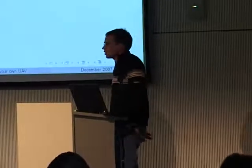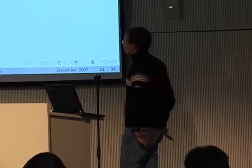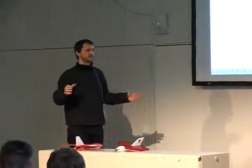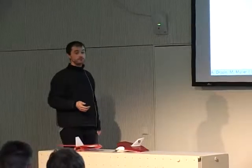The board configuration can be single or twin processors, but like I said, we're not using the twin processors anymore because we're confident that the one processor system can cope with the whole load. But we can still use it if we have some real huge aircraft, for example, where we want to make sure that the RC link is still working; we use the two processor boards, and we can still do that with the software. You can also use this feature not to segregate different critical code, but if, for example, you have a process that needs a lot of CPU power, you can use this feature to offload the intensive task to another processor.